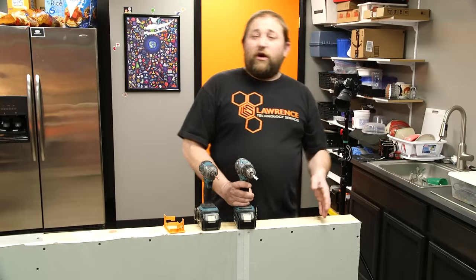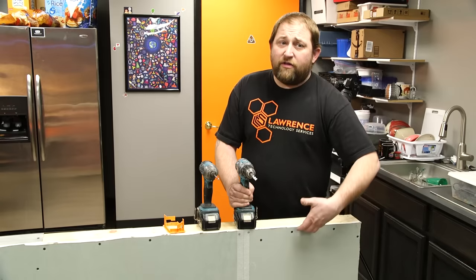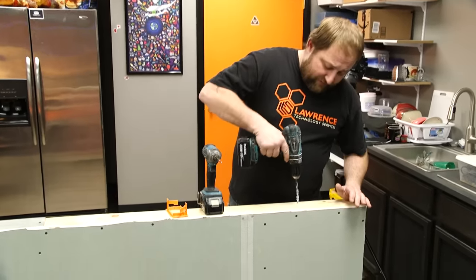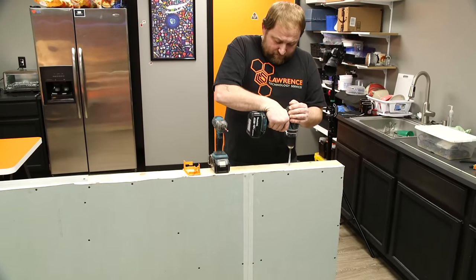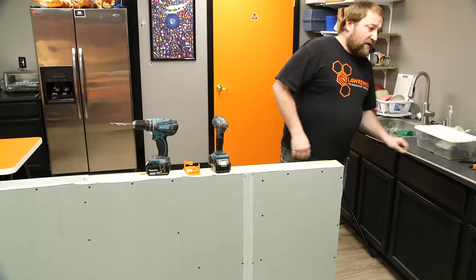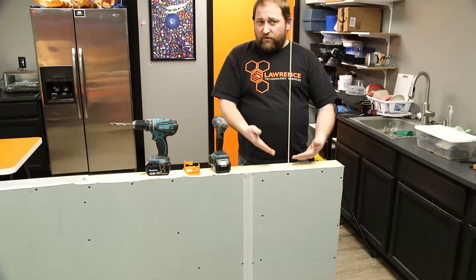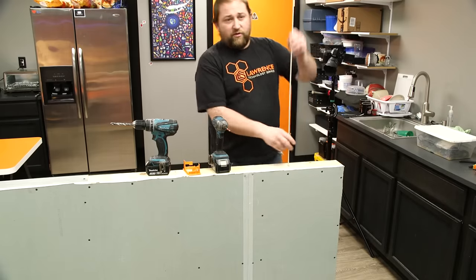The first thing we want to do when doing a wall fish is always go from the top of your wall down, because you can move your ceiling tile. If you make a mistake or hit a fire stop somewhere in the wall, it stays hidden above the ceiling. So let's go right in here through the top of the beam. Now we've drilled into the wall. I always recommend you get your fish rod and find your baseboard — if you've got enough rods to go down through the wall, you just confirmed there's no fire stop in that particular cavity. With that, we'll pull the rod back out.